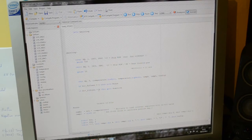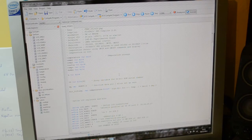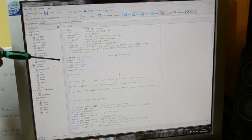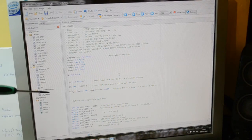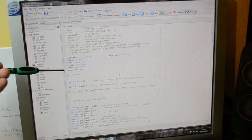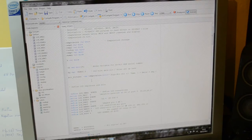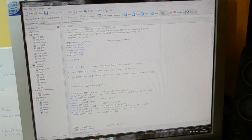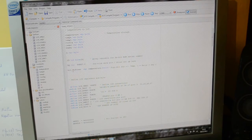Temperature is a variable word because we've got 16 bits of data, not 8 bits. Temperature_high is a variable byte, temperature_low is a variable byte. You can set high and low temperature alarms. Configuration is a variable byte so I can read it and display it on the LCD. Temp_C is a variable word — 16 bits of information. Dummy is used for the math. ID is a variable byte array times 8, used to get the 64-bit ID code from the chip.